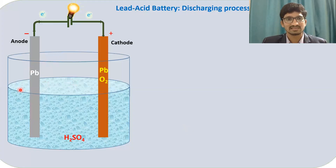In each compartment, the cell consists of an anode and a cathode. The anode is lead metal and the cathode has lead oxide (lead dioxide) material. Both are lead-based — one is pure metal, the other is lead in a +4 oxidation state. The three main components of lead-acid are: lead as anode, lead oxide as cathode, and dilute sulfuric acid as electrolyte.